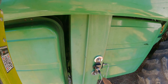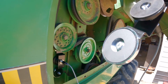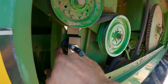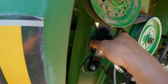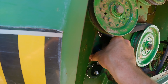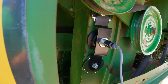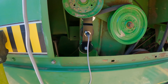Now we just have to install these sensors, which I'll show you once I have them done. This little glass thing on the end of this black piece is a protector for the actual sensor — that little glass piece goes through the seven-eighths hole that you drill. You get that in there and then that little black piece should be tight against the frame of the combine. Then you just tighten your sensor nuts and they're pretty secure. We're going to have to figure out how to really keep these cords safe.